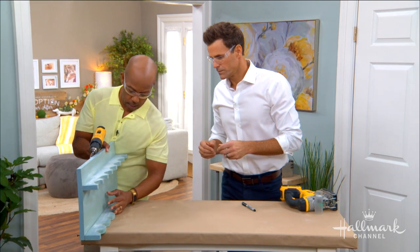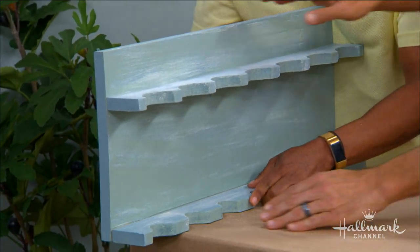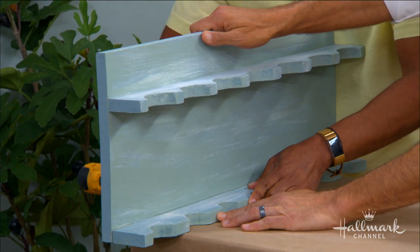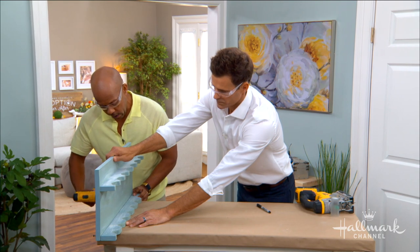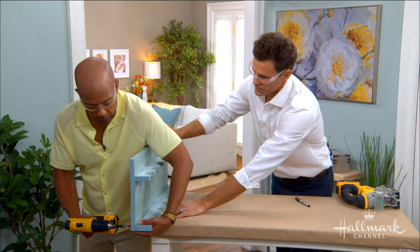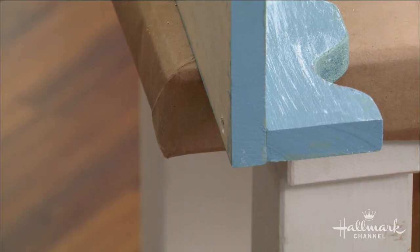The one with the narrow neck — what I did was put that right at the front edge, and the back one you can put about two to three inches down. Three screws will do it, because it's really not holding a lot of weight. There's not a lot of lateral force here; the bottle is just sitting straight down.